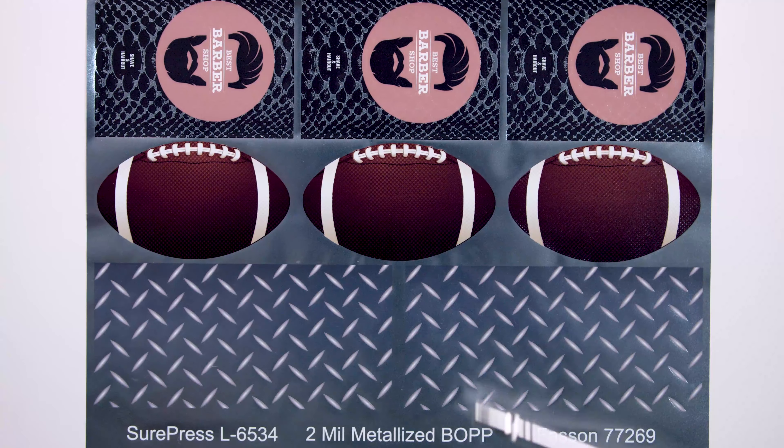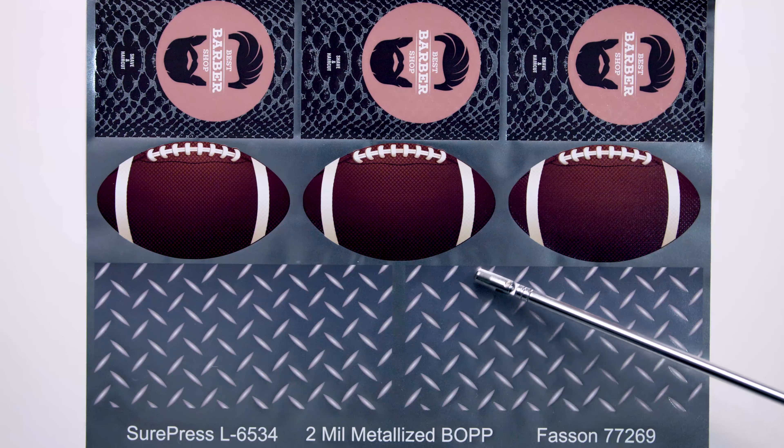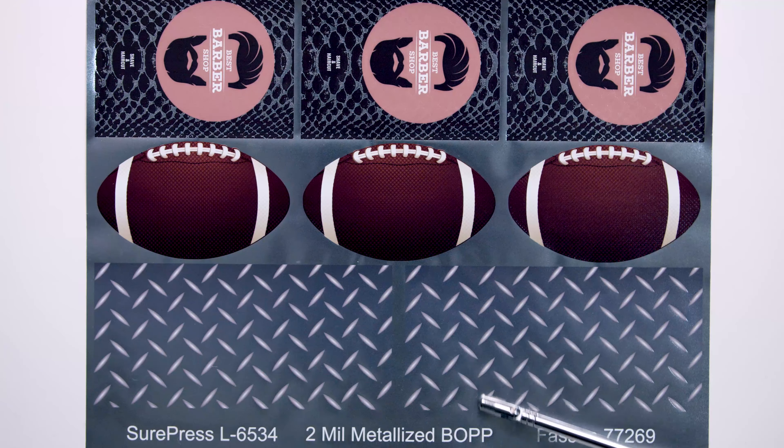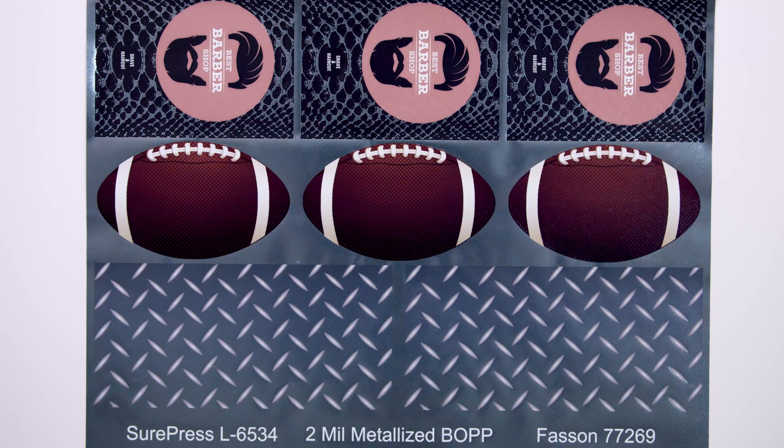At the bottom of this page, we see a diamond plate pattern with a gradient as the background. Notice that the gradient is very smooth and even, fading from darker at the top to light at the bottom of the image. The elements of the diamond plate pattern are printed with white ink and gloss varnish, while the background has a layer of matte varnish, showing yet another example of a textured tactile finish. This would be a difficult image to print without tight registration between white ink, color, and digital varnish.